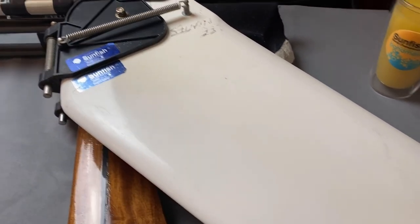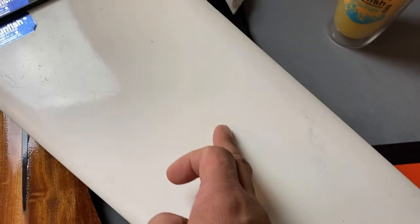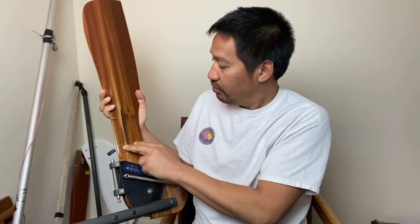Here is the traditional rudder that's swept back. I have the cheeks pretty much next to each other so you can do a good comparison. And here's the AeroSouth rudder, which is thinner and longer, and goes deeper into the water because the center of effort is closer to the boat versus the traditional rudder. If everything is equal, you would get more weather helm from a center of effort that's further away from the boat. The rudder is made of sapele mahogany reinforced with carbon and has an epoxy coating for protection. One notable feature is that it is made in the United States, designed by Kent Meiskeegs in North Carolina. The carbon fiber is from a factory in Utah — it's all manufactured in the United States, which is cool.